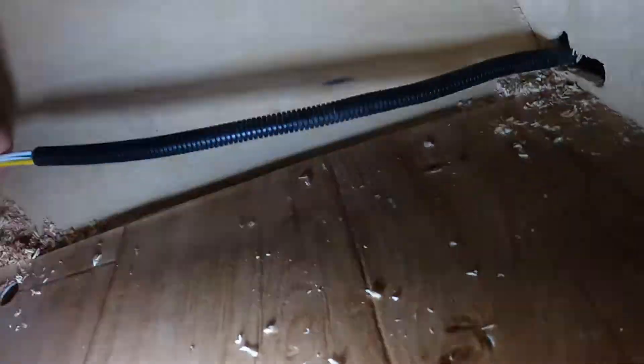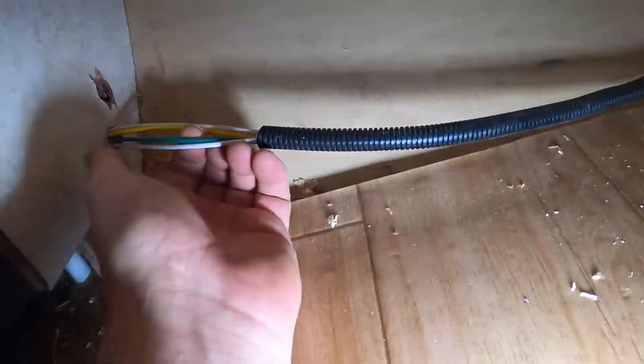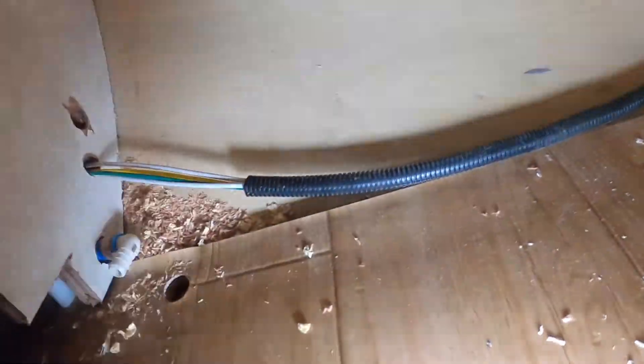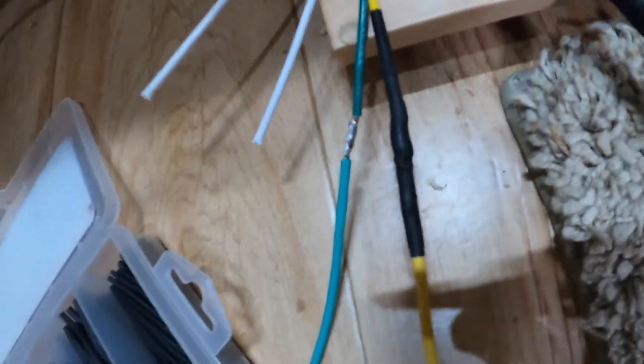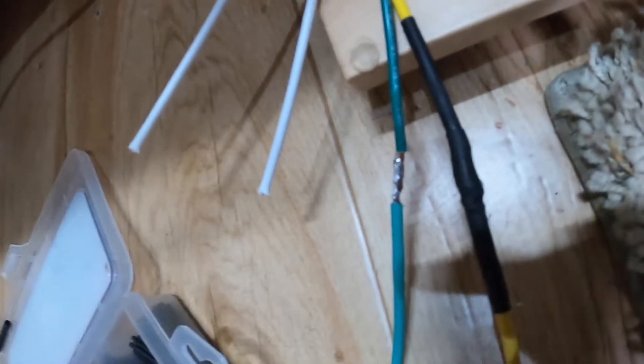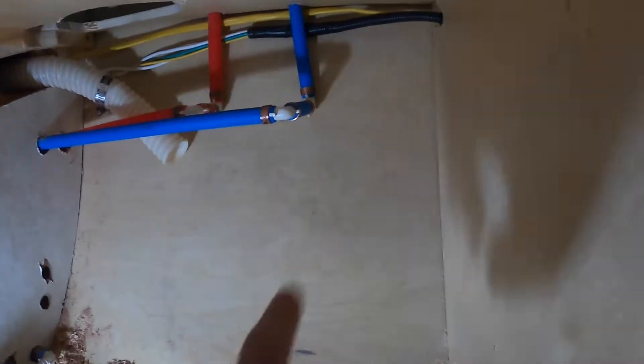Next I'm going to take this guy out. One of these wires — the green one — comes from the tow vehicle to run 12 volts, and the other comes from the converter so you can run 12 volts here too. I'll need to turn both of those off and reroute that cable from that hole to the other hole, get it up out of the way. I've got to extend the 12-volt supply lines to the fridge, so I'm soldering them and heat shrinking them, color coding them the same so I can route these cables in the new path.